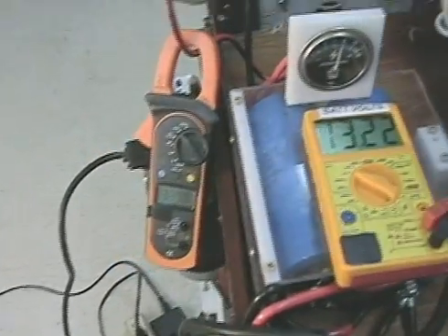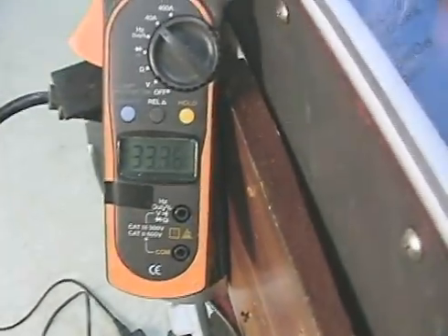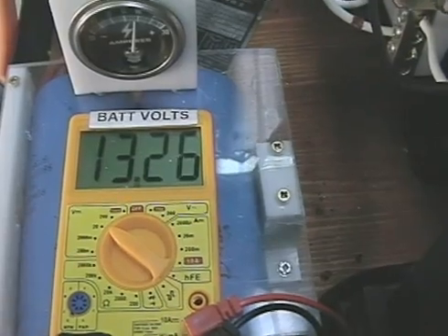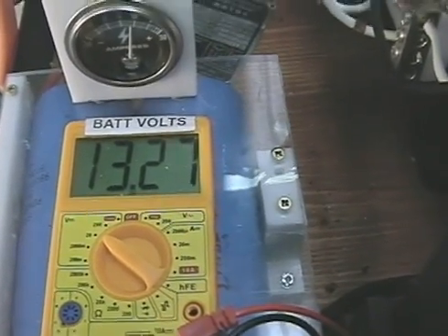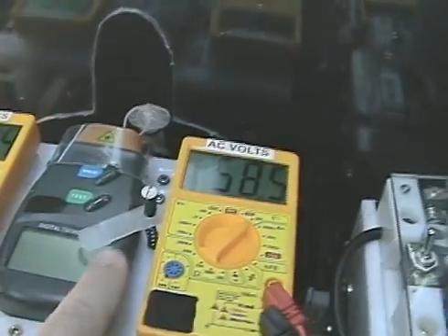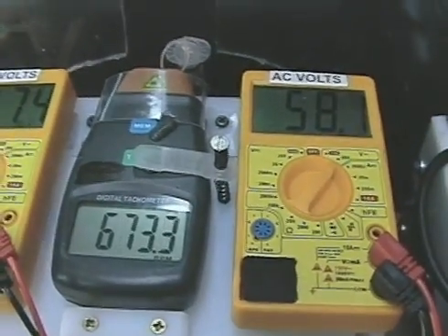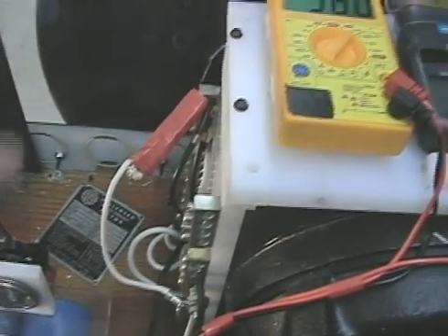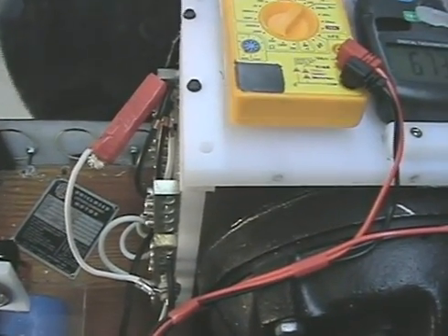It's maintaining right around 55 volts, dumping 33 amps into the batteries. The batteries are climbing to 13.26 volts. I'm bleeding off 300 watts right now. It is running at only 673 RPMs because I'm backfeeding current back into the head end of the induction generator.